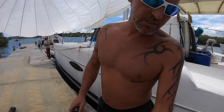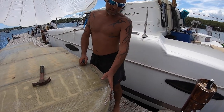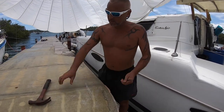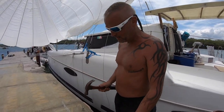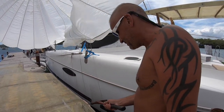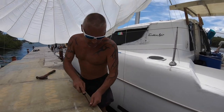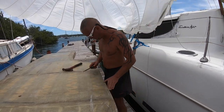When we took this out of the mold, there were a couple of places along the edge where the fillets for the rounded edge caught — there wasn't enough wax or something. So they stuck a little bit here, here, and here. I've got a real hammer this time — I've been allowed to use a full-size hammer. To be honest I'd rather have my little hammer, but I just want to try and remove some of this material before I do a bit of sanding. This part of the mold didn't quite work, but it'll come off fine with the sanding machine.